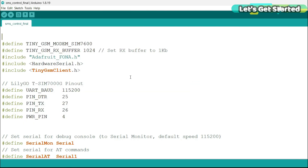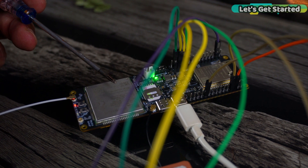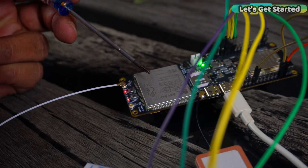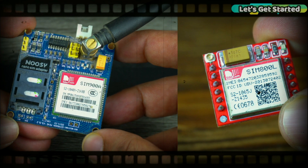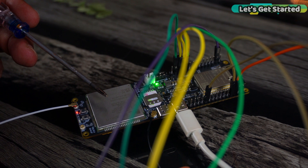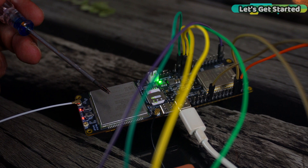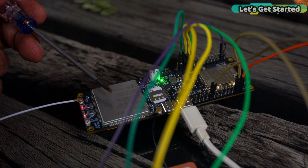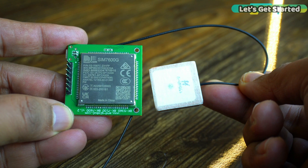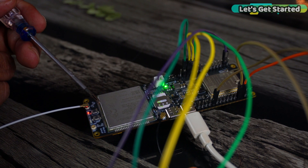Let's go ahead and start with the practical demonstration. As you can see, I am using a 4G SIM in this module. The amazing thing about this module is that it is also completely compatible with 3G and 2G networks. You can see it is connected to the network. If you use SIM 900A or SIM 800L GSM GPRS module instead, it won't connect because those modules only support 2G SIM cards, and 2G networks are almost finished worldwide. So I recommend using this 4G LTE module or the SIM 7600GB.